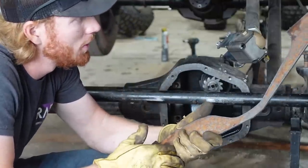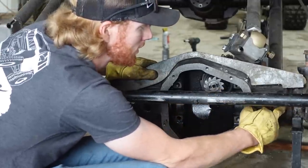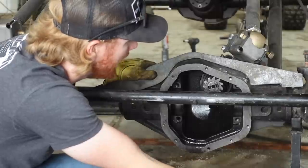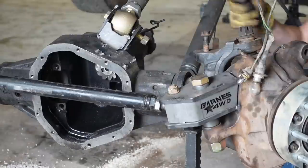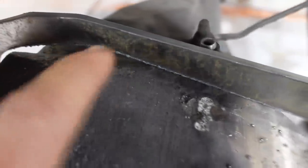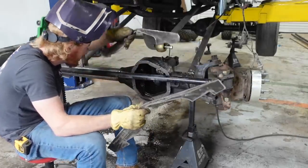I'm back with a new truss piece. The only thing that's not making it fit right is that I need to cut this collar back off the cast to get to the good metal so I can weld really strong to that. There are some casting differences I'm going to ignore. Now that we have the rear one made, I want to make another one that comes in front, then cap the whole thing with a nice top. I now have my two pieces and they just need to be welded on.